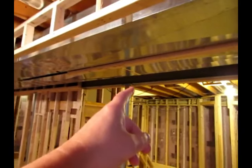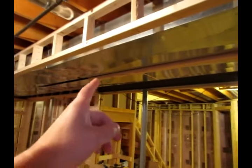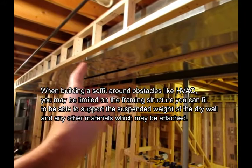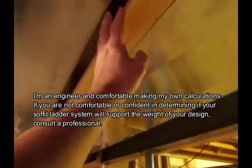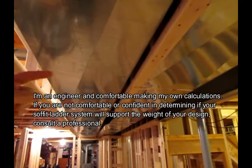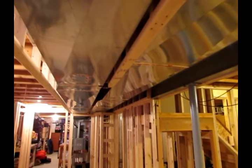This is a fairly long span. We've got about a 60-inch span from where that beam is on that side all the way across to where I've got this ladder built and suspended from the joists up above. So we've got 60 inches of drywall width to support. I'm not really thrilled about securing a few stiffeners across here and hanging all of that weight of drywall, plus any electrical fixtures or other things we may have. So I'm also building a ladder in between here, which is going to give us an additional place to secure a stud all the way across, giving it some security in the middle.